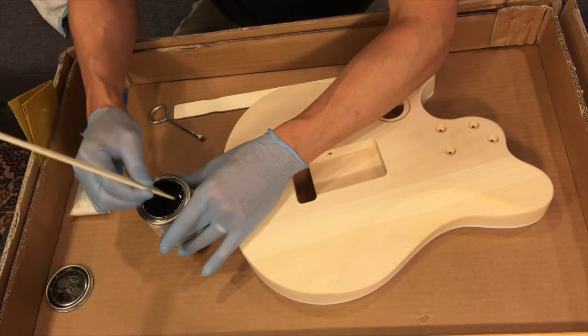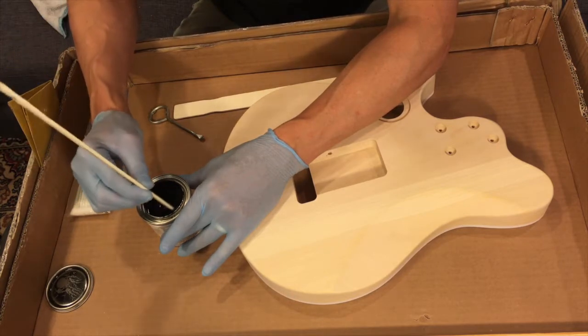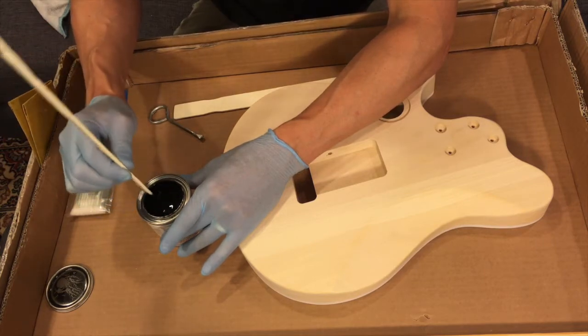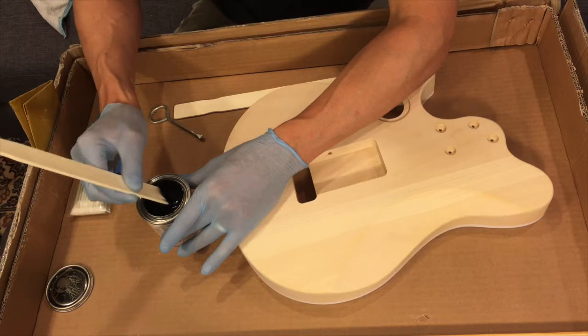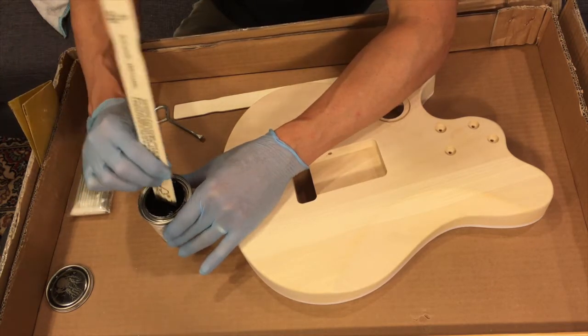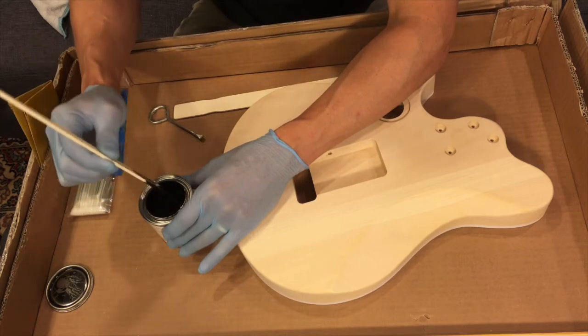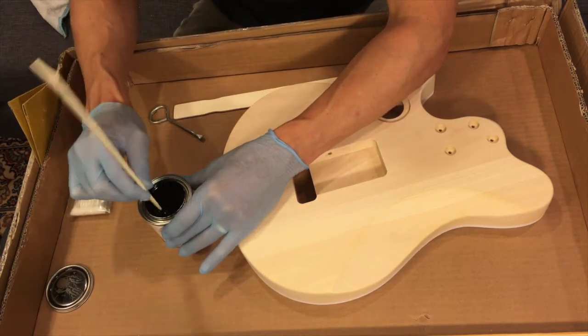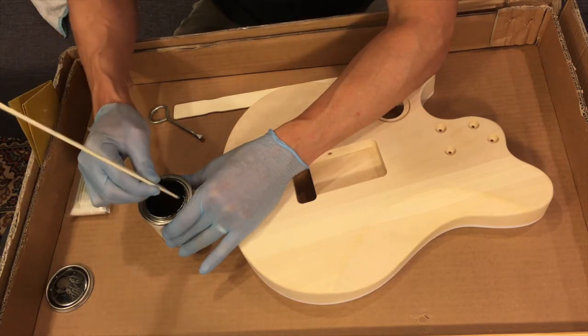One thing you gotta be careful of, if you use rags with this stuff, don't just lay the rag around. You have to lay it flat someplace, preferably outside. Otherwise it could combust, which is freaking nuts. For those of you who don't know what that means, it could catch on fire, and anything around it.